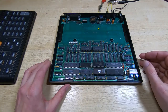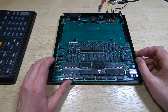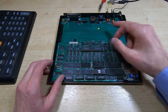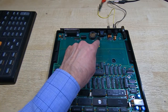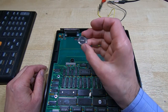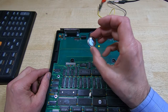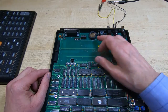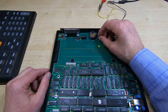The way this circuit is laid out, there is of course some battery-backed RAM, and normally with battery-backed RAM you need some sort of CMOS battery controller. The battery can be seen at the back in the socket and that wasn't there when I got the unit. The IC that's missing here - I pulled that out to simulate the fault that I was seeing. The battery that was fitted was just tacked to the board; I think at some point this has been replaced - there's also a little jumper on here that wasn't original. Rather than keep soldering batteries to the board, I fitted a coin cell holder and put in a coin cell.